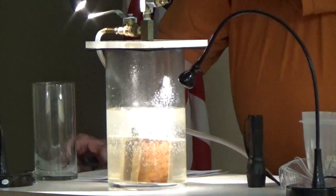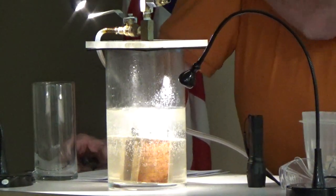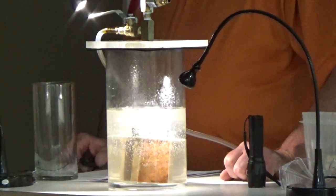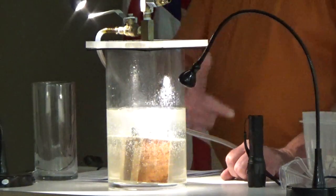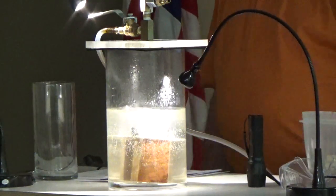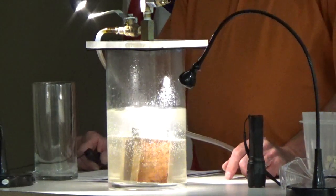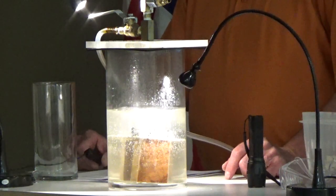Epoxies have too high surface tension and too high viscosity to penetrate. Probably wouldn't penetrate, no. So the resin that you use is thin, like water? Thin as water, yeah. It cross-link polymerizes under heat, which is the key.